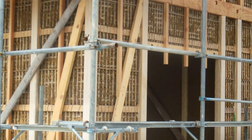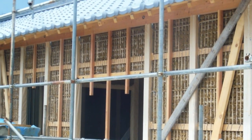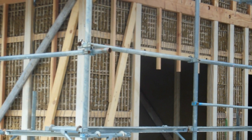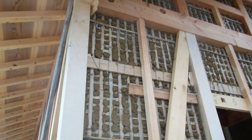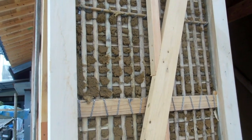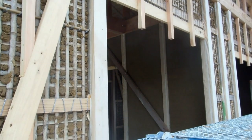What we found most interesting is this wall. Those of you who have been following the old Japanese farmhouse renovation videos would have seen these walls — they're actually made with bamboo tied together with string in a grid, and then the wall is packed with mud from the inside. What they want is a smooth surface on the inside, so they pack the mud against the bamboo and push it in with a trowel to make it smooth and push it through the bamboo so it stays in place. Bamboo and string, all tied together and then tied to the frame, and the inside surface ends up reasonably smooth.